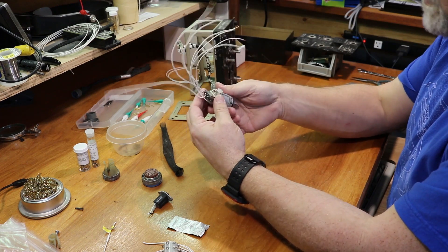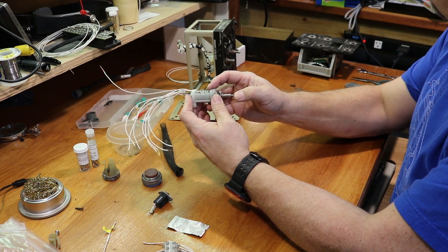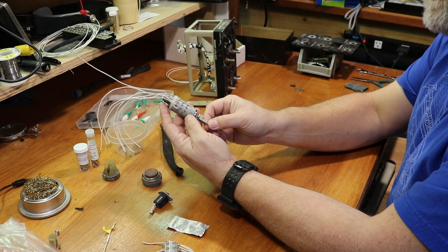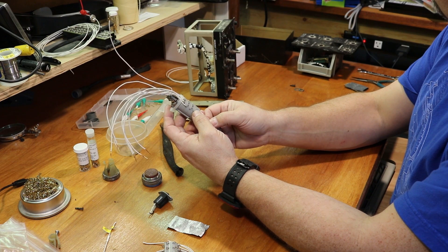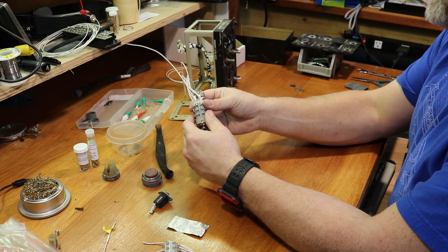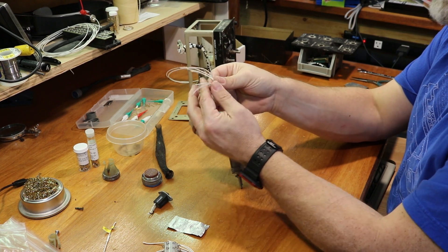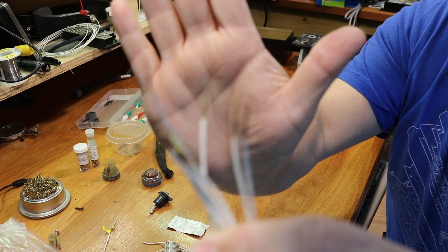Here's one of the switches I've pulled out so far. I believe this is the EL scan — a five-position rotary switch with a push button. This one has already been pulled apart. I've wired new connectors on it. I'll try to focus so you can see the mil-spec crimp-on pins on it.